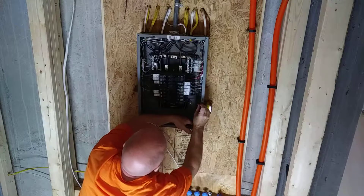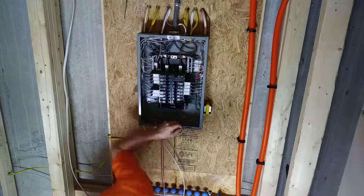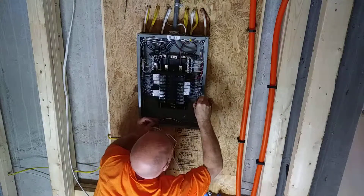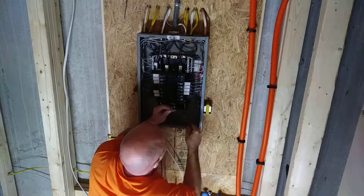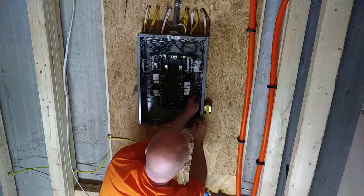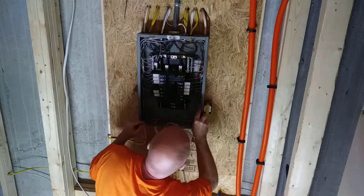The contractor had doubled wires on the neutral bar, so I guess I can double them too. I'm going to go right to this one — that's another piece of 14 ground that's by itself. I'll make sure they're both in side by side, and both are through the hole.